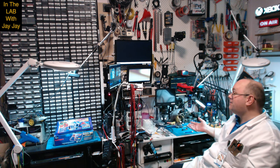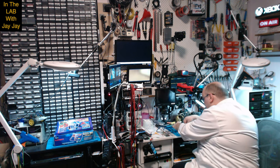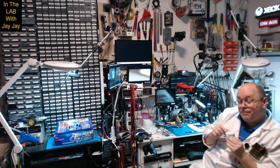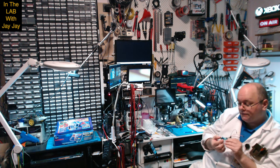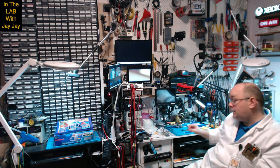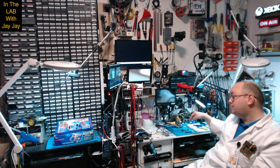I think you've seen everything, haven't you? You've seen our little circuit board. So we've got our piezo buzzer, our potentiometer with a little screw tip. We've got some headers for connecting to our device, and that's everything. So it was just a 2K potentiometer in series with the piezo buzzer.